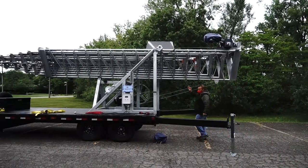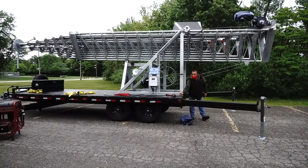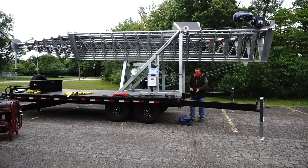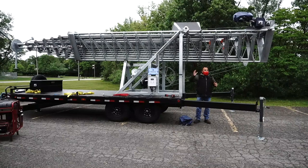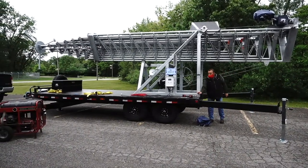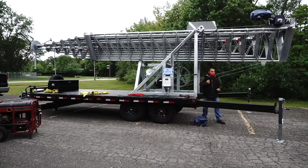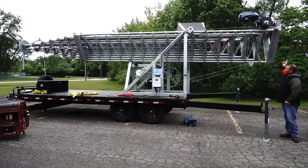And these plates, this is the safety plate. This plate needs to stop here on the trailer, and later you connect the bolts, two on each side. Like that, the tower is ready to extend. So in that position, you have this and the cable, because the winch is holding the tower. That's why you have that safety plate on each side.